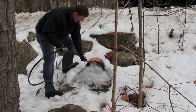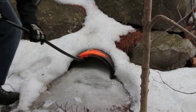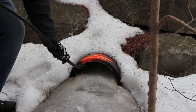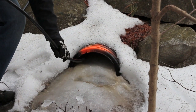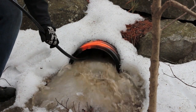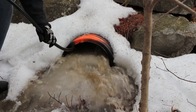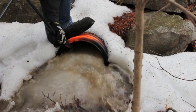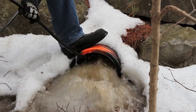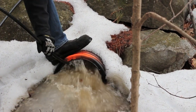Right now we're moving up through the culvert. That leading jet is melting the ice ahead of it while the rear-facing jets are enlarging the hole. This culvert seems like it's frozen pretty good — could also be a lot of dirt caught inside there. Seems like we're getting a good amount of flow here. Looks like it was just frozen at the end. We'll pull it back and forth a few times to see if we can make a larger cut through it.